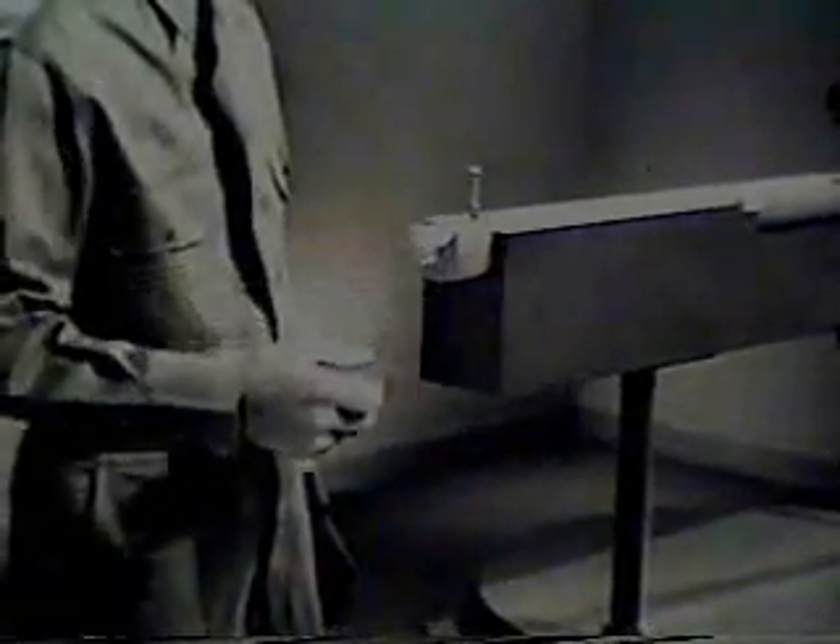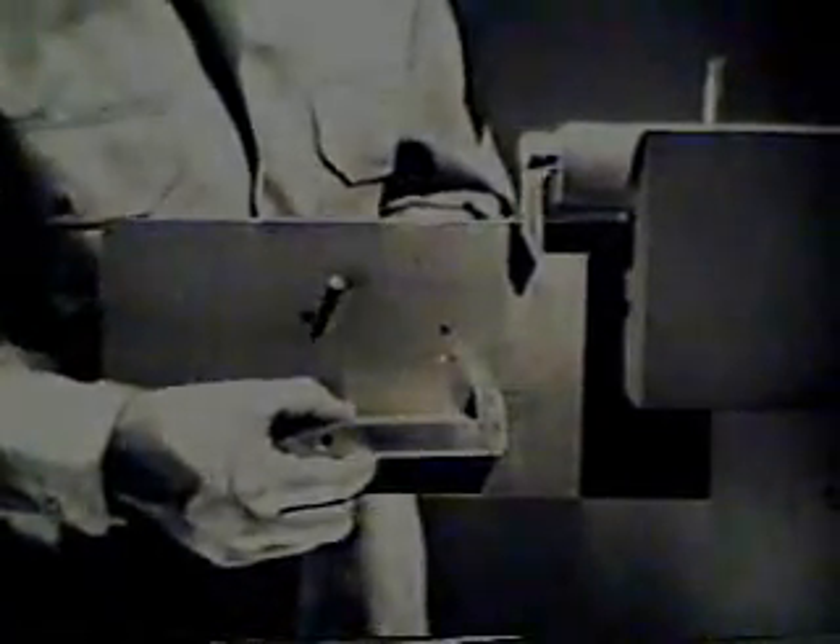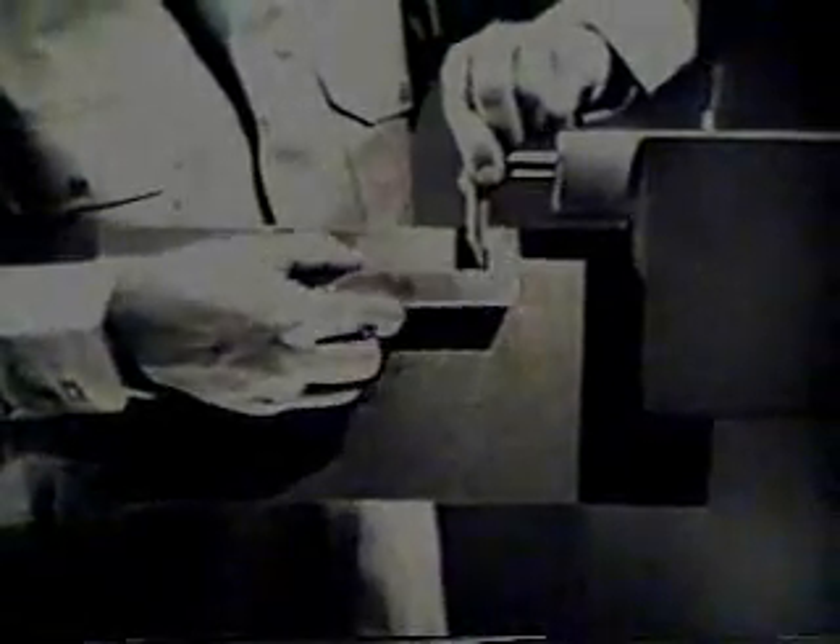It's awkward to pull back the pin and release it by hand each time we want to fire. We need a means of holding the pin back until we're ready to fire. This is known as cocking. Supposing we put a hook or tang on the rear end of the firing pin — we can still pull the pin back and release it by hand. Now we'll rig up something to hook it onto. We'll have to add a block to the receiver to hold the parts we'll need. The first part is a latch-like piece known as the sear. If we hold it under the firing pin, we can catch the tang of the pin when it's drawn back. We'll mount the sear on a pin so that it will pivot freely.